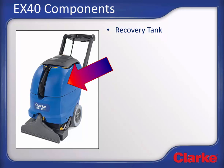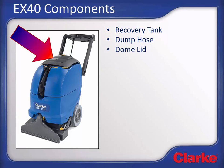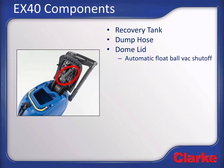The recovery tank dumping hose, shown here in its storage location, allows easy dumping into toilets, slop sinks, or other proper waste disposal location. On top of the recovery tank is the translucent dome lid that allows you to see recovered solution entering the tank. On the underside of the vacuum lid is an automatic float ball vacuum shutoff that protects the vacuum motor from water ingestion if the recovery tank is full.